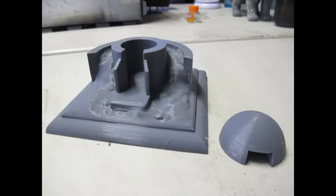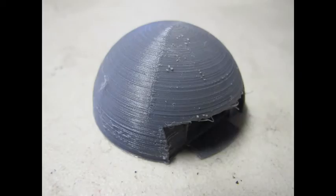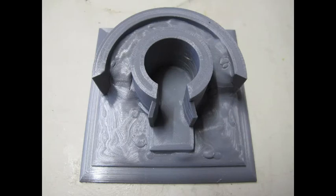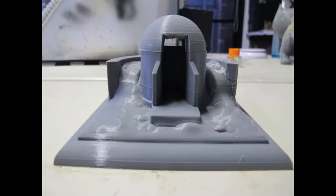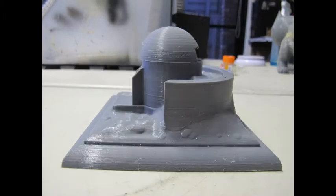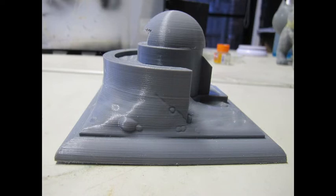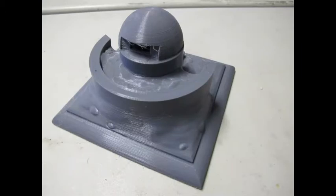Outputting two types of models — a very large, plain surface diorama with basic geometric shapes did leave some stepping and artefacts. It was minimal support so the underside is a little undesirable. Overall it works out perfectly at 0.2mm layers and about 2mm thick walls. On the other hand, I expected the AK-47 and milk crates to completely fail, but they were detailed and small enough to peel off the bed and be completely utilised. Doing finer detail with this generation of 3D printers is far more possible than earlier generations would have managed.